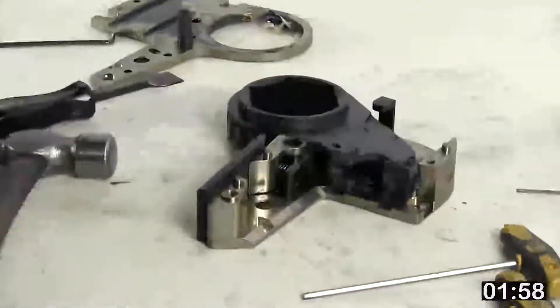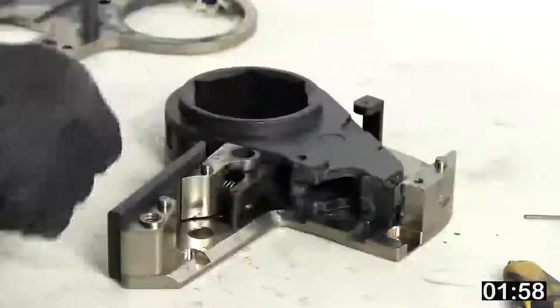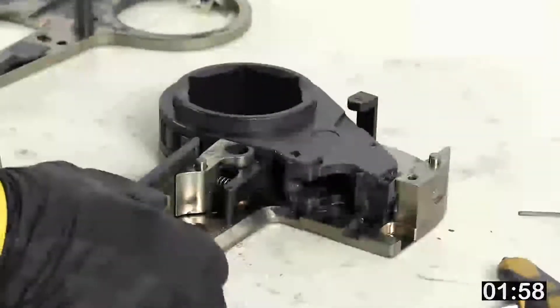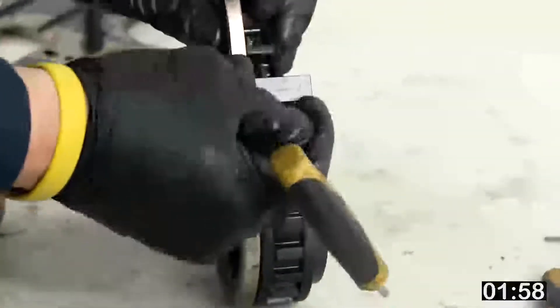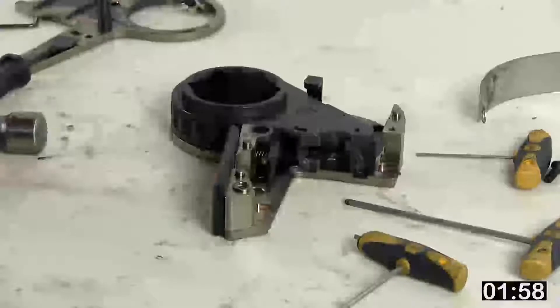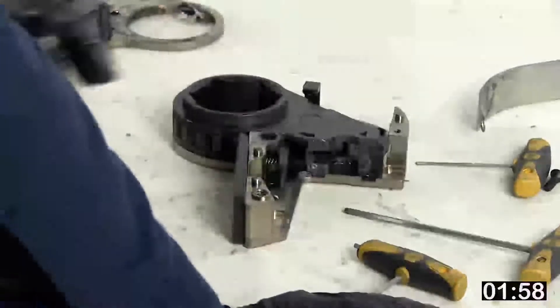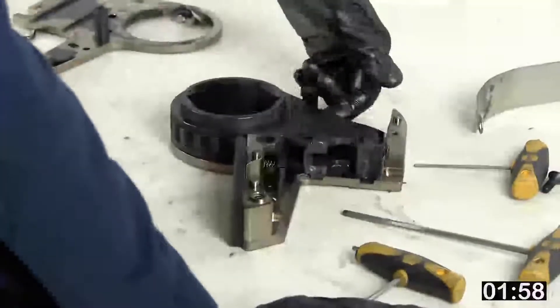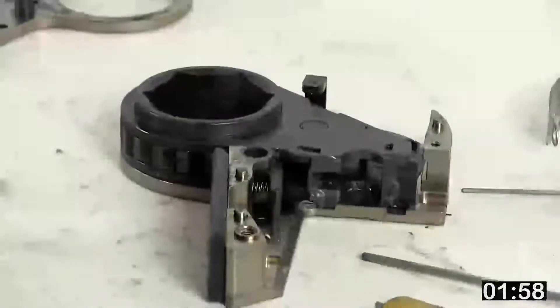Okay, and then we have their version of the insides. There's a drive plate here, the ratchet. They don't have a segment — they use the top piece up here as a segment for a pawl. Spring there, spring here. The inner workings — a lot of parts in there. These two side plates come off, there's another spring up here, the ratchet, another spring here. So there's a lot of stuff going on there.